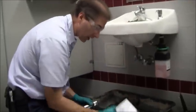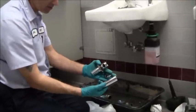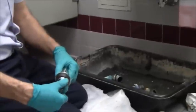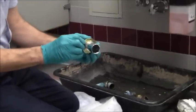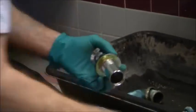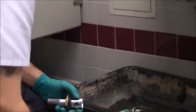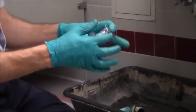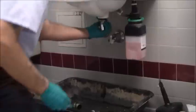All right. We have the Moen basket strainer. It comes in a kit that looks like this with three parts. Basically what you need to do is feed this up, and then I'm going to screw this down on this side of the sink, and then I'll tighten up this nut right here with my channel locks in an effort to bring that in tight. I can also see if I can put a little bit of plumber's putty in this ring right here to seal that down. So for now, I'm just going to bring this up.